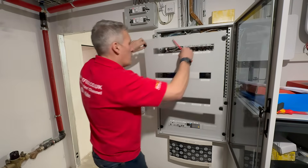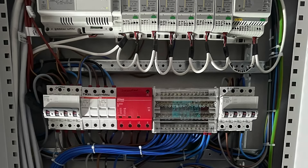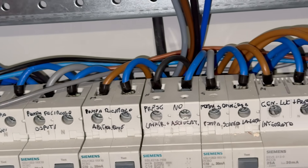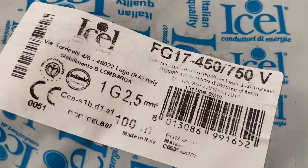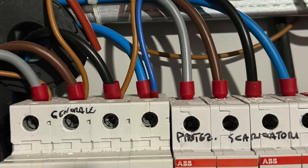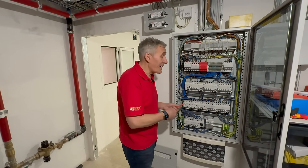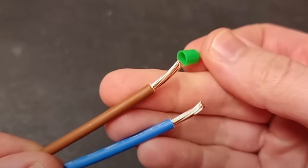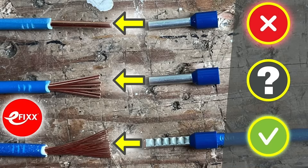We can see lots of other home automation stuff in there. Siemens box, similar to how you build up a rack-mounted unit — all looks pretty neat and tidy, all cables immaculately herded up. Just to get something out of the way when it comes to ferrules: Italian conduit wiring uses class 5 conductors, which have multiple fine strands of copper making them quite flexible — you need that to get through those flexicon pipes everywhere. You put a ferrule on the end because that's suitably treating them. UK conduit wiring uses class 2 conductors with only 7 individual strands, so they're not as flexible and it's generally not recommended that you put ferrules on the end.